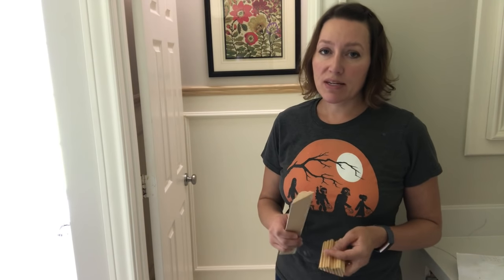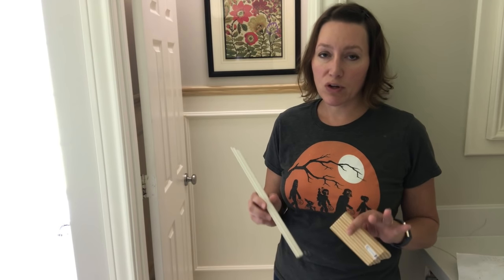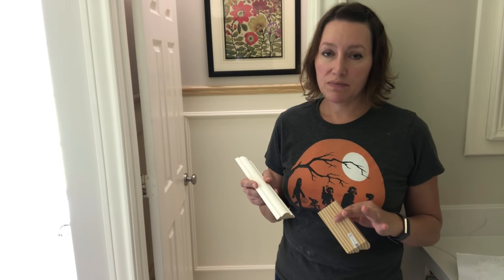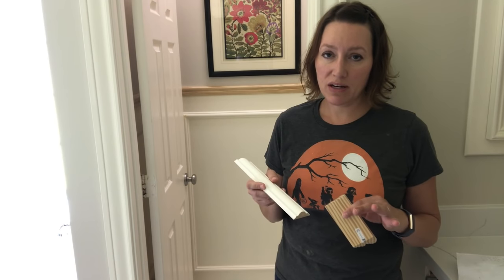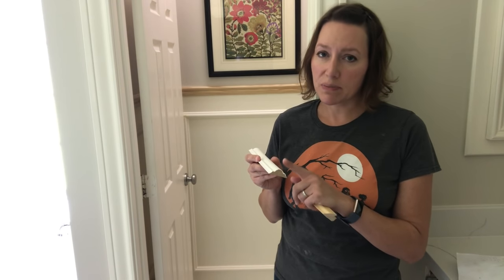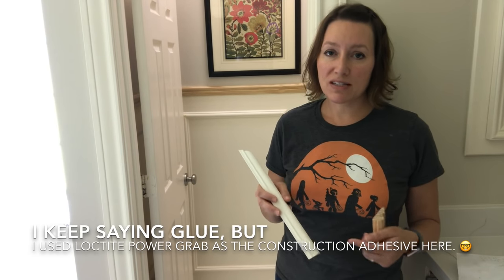To do this it's pretty easy. All of these products are pretty standard at Lowe's, Home Depot, or any of your local lumber suppliers and hardware stores. Both of these should be in the chair rail molding section. This one is the picture frame molding that you see behind me — it's perfectly symmetrical on either side. If they don't have exactly this design, they'll have something very similar. You're going to want to cut perfect 45s and remember to have the opposite sides on the picture frame the exact same length. Just use your level and get everything up on the walls nice and straight.